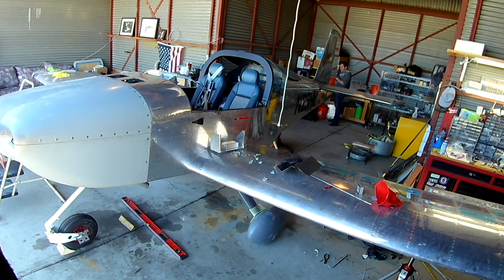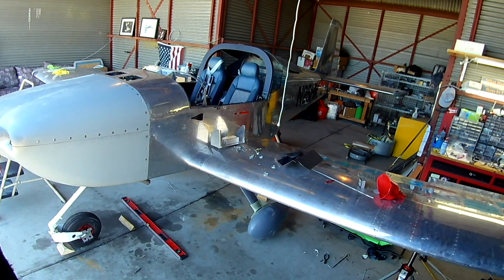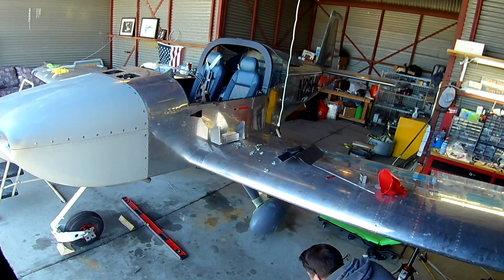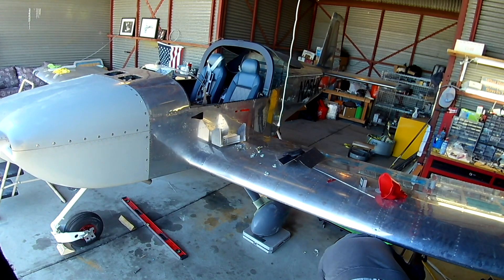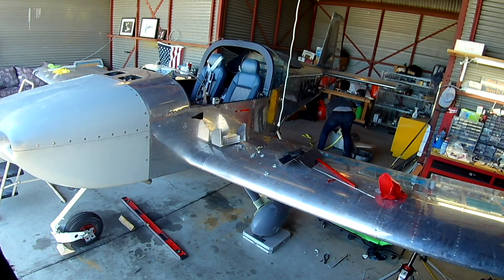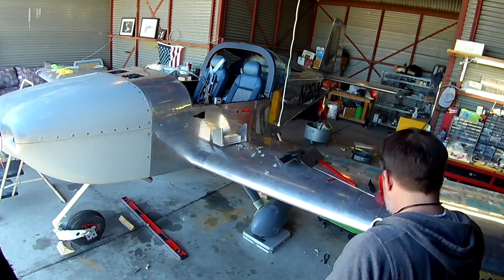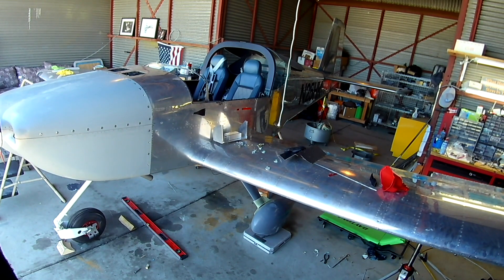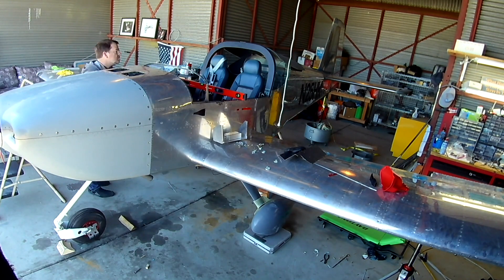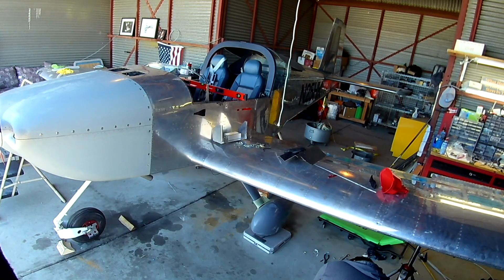This is going to be really interesting because we have to position the plane as though it is at flight level, but at the same time we need to have the front wheel off the ground. As you jack the plane up, you can see the front wheel is sort of moving back. The scales we use for weight and balance are the perfect height once the mains are on. Then I rolled the tie-down over, pulled the tail down and secured it so the nose just gently floats above the ground — like a 16th or 32nd of an inch.